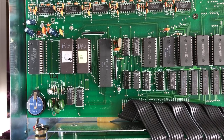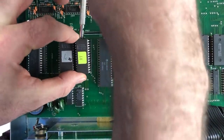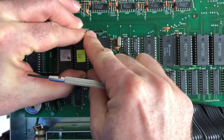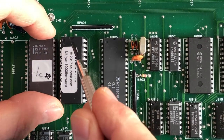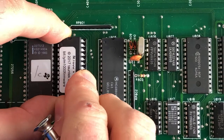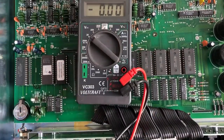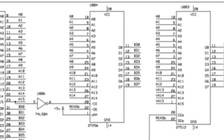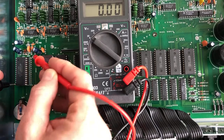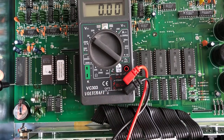There's one more thing we should do right now. While the synth is open, we should exchange this chip here, which contains the old program, and replace it with version 1.2. Take care that the little notch is facing the back of the synthesizer, and be very careful when inserting it — one row first, then the other, then press the chip in. Now let's check: you have to check between pin 14, which is ground, and the one in the upper right corner. As you can see, this is three volts going through the memory chip, so everything's fine.